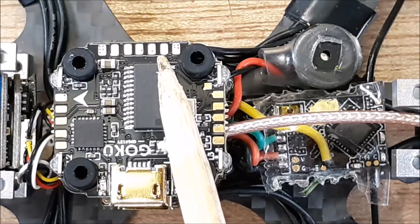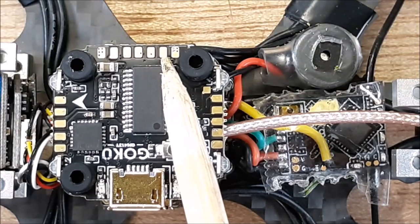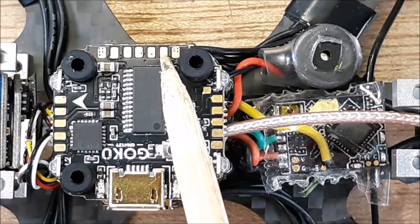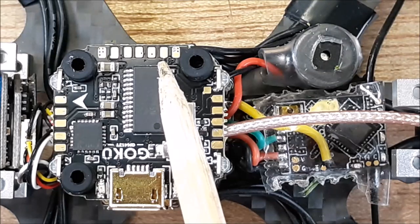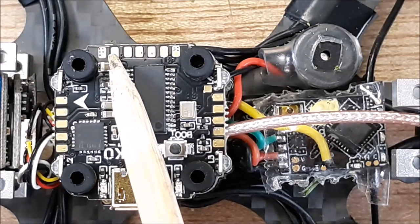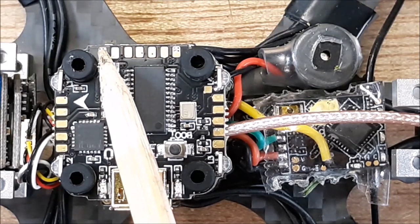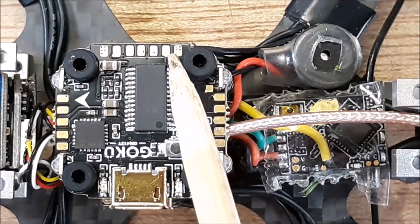And then if you have the second pad in, if you're working with like a Spektrum receiver that needs 3.3 volts, you can pull it off of this pad here, okay? And then in my case, I'm running a 5-volt pad. So I'm actually running 5 volts off of this pad. And then this is the ground. So there's actually two grounds. There's one here. And then there's also one over here.